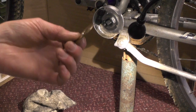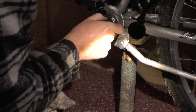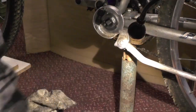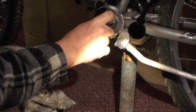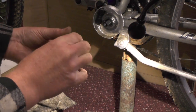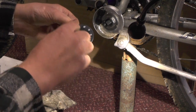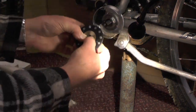I found this brass washer. You need to measure your square on your crank — these are slightly tapered for the crank to fit snugly on — so I'll measure at the back and then make a hole the same diameter as across the flats. Then I'm going to file a square into that, leave all those tabs in to keep it centralised, put a couple of rivets in to hold that ring in, and then press it on so that the square drives the ring.